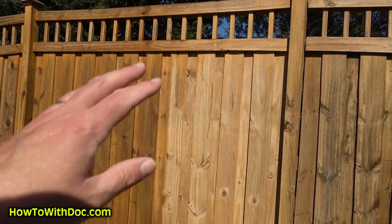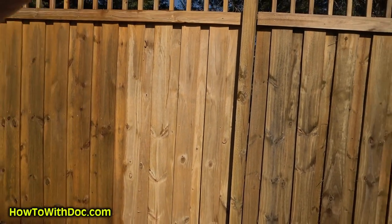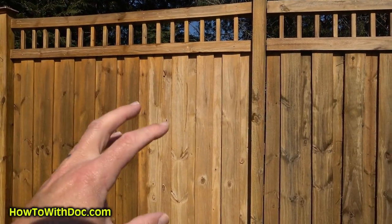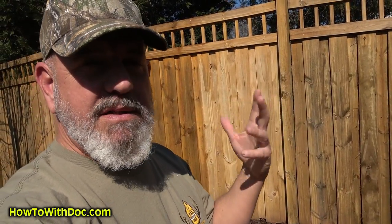What I do need to do is come down to a point where everything is off of it and it's clean and ready for the stain that's coming in. So now he gets to do the hard work. He's going to come out here, treat all this with the 30 Second Cleaner, pressure wash it, and then we'll wait for a day temperature-wise — it's February, we want to be above 50 degrees — and we'll come out here and spray it. I'll put that on video. Hit subscribe.